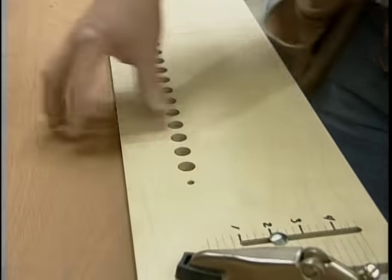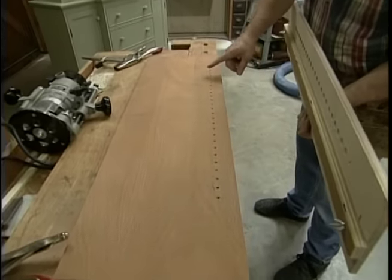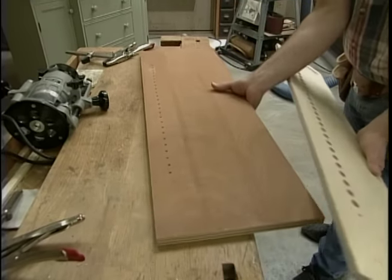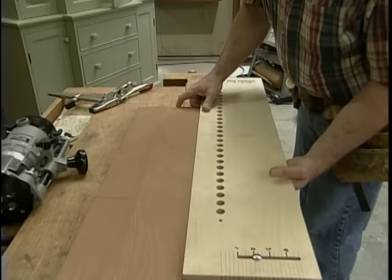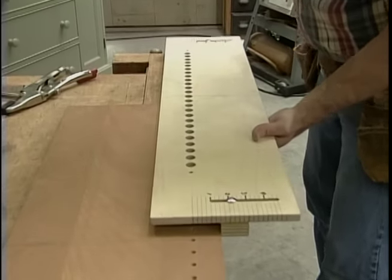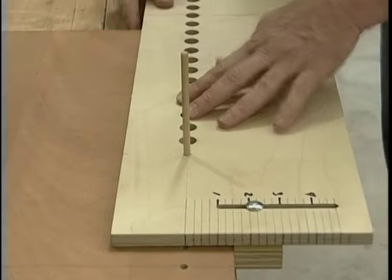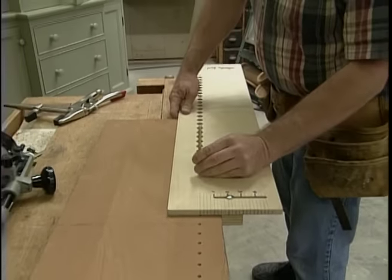Let's try it out and make some holes in this piece of plywood for a mythical cabinet. I've set the stop so that it's an inch and a half from the center of my holes, just run that up against the side of the piece, come to the middle, line up the center points, and then clamp the whole assembly to my workbench. I've installed the collar in my router and I have a quarter-inch spiral bit; the depth is set so it'll cut a half inch into the plywood. I start at one end and work my way down. Now to do the other side I just turn the piece around, set it up again, and do the same thing. Now let's suppose this side piece was twice as long — for a pantry cabinet, all I do is slide the jig down, take a quarter-inch dowel pin and slip it in one of the holes that's already been drilled, and now I know it's set in the right position and I can continue to make shelf pin holes.